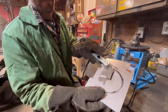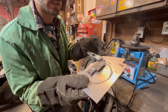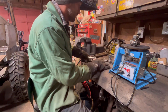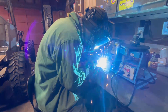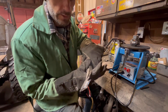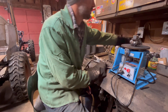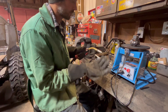I'm welding with mixed gas and .030 wire, just going with the machine's settings. It's a little heavy — it's close to 3/16ths, I think I got two thicknesses there. So I like a welder that's foolproof and you can just hook it up and go. It was a little bit fast on the wire speed for me, but that could be because I have it set up for a little heavier material. Let me bump it down to 1/8 inch — I'll flip this piece around and we'll do another bead. Much better. I had a lot more control and less of a bulge on the weld. Very light trigger feel, which is really different from the machine I was using. On these stiff gloves it triggers really easy, so for fatigue it'll probably be good, but I just got to get used to it.